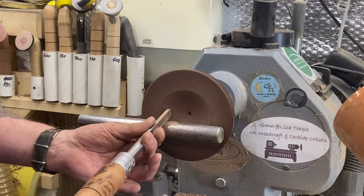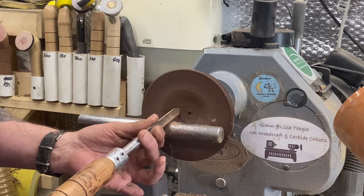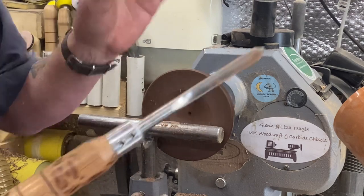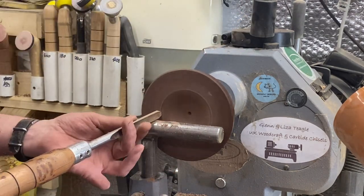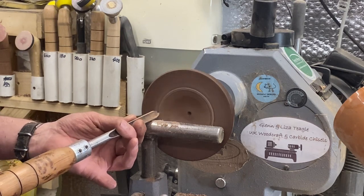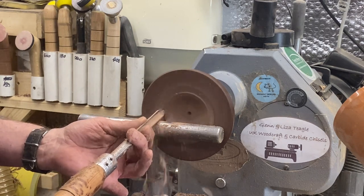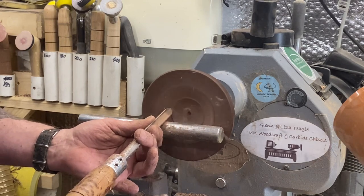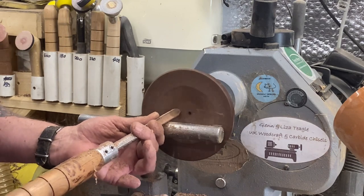And all we have to do is flute closed, roll it, pick up the cut. It's as simple as that. You don't need to overhang it or anything. Flute closed, it can't do a thing, okay? Flute closed, we rotate it, we just throttle back a little bit. There's the cut, it will pick it up, and then we just let it follow forward. It will take its own path. If you miss a bit, come back, just rotate and pick it up again.